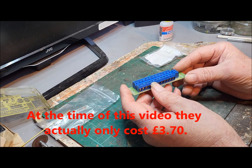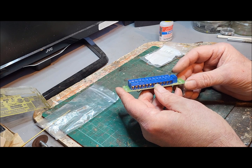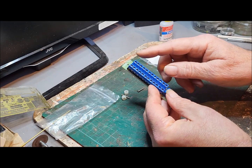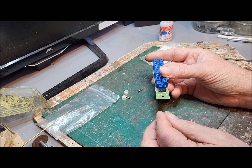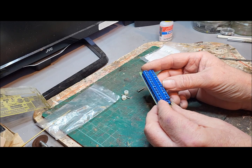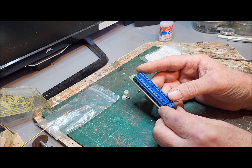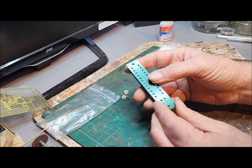Especially if you're wiring DCC, where you've got quite a few feeds from different sections of track, but a power bus going in. You can wire either polarity to these 12 connectors either side, and then these just feed out to 2 wires which can go to your controller or control panel to take the power in and then distribute it out. Equally, you could also loop round here and in effect connect 24 of the same polarity wires up. An absolute godsend.